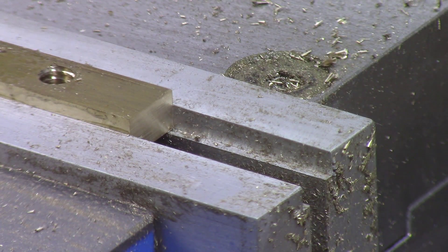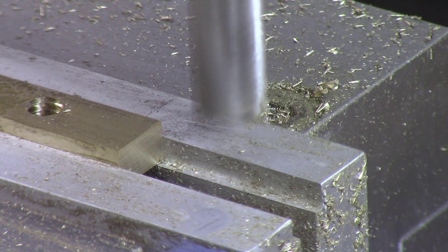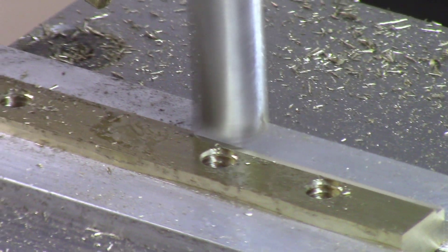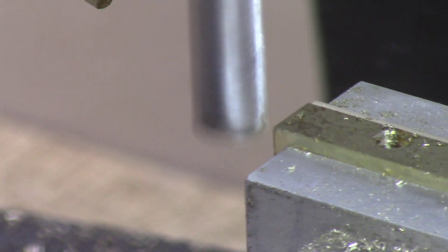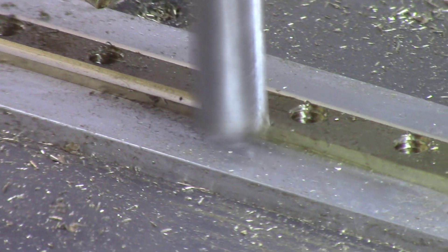The final step is using a 7/16 inch end mill, which is 0.4375 inches in diameter. We are cutting a center channel which is 0.2510 inches wide, and trimming off the outside edge to give me my dado. This is the part that will lock into the channel on the rail.